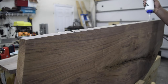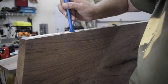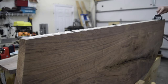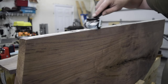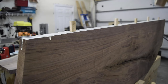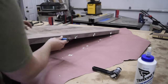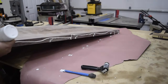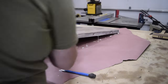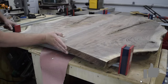The dominoes help make sure that the jointed faces stay flat during the glue-up. Being that this is such a big piece, I wanted as much time as I could have with the glue-up, so I'm using Titebond Extend. I find that using a brayer works really well to help spread the glue for these big glue-ups. Leave a comment and let me know what your favorite glue-up items are. If you're enjoying this video, please give it a like — it really does help.